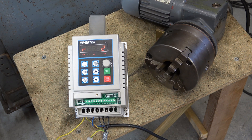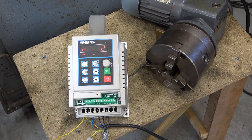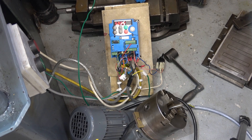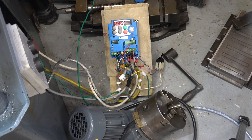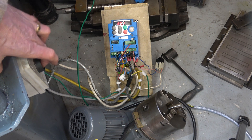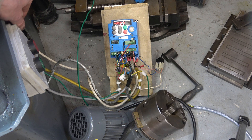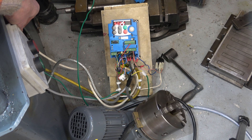So that's the difference between an inverter that costs around £250 and one that costs £60. What I might have to do is swap those inverters over — a bit of a shame, but use this one to drive the shaper. I've connected up to my Jaguar IMO inverter just to make sure there isn't a problem with the rotator. The display says 50 Hz, and the lowest I could get even with full torque boost on the new inverter was 2 RPM. Let's give this a go — you can see the chuck going around. We're up to 50 Hz, that's 18 RPM.